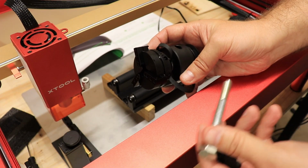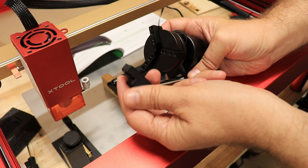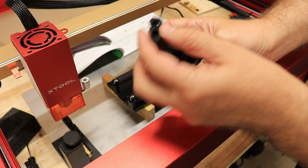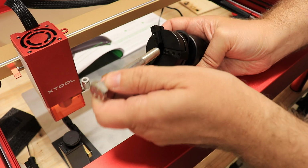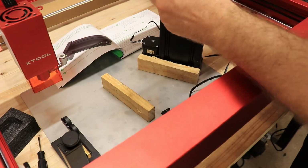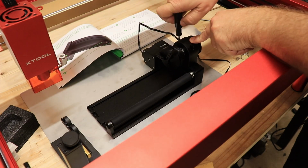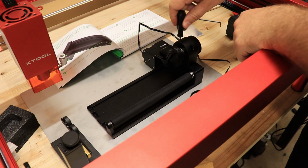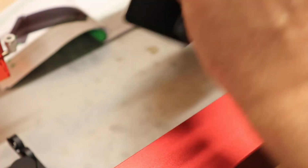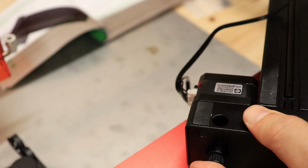And now I want to use the chuck to engrave something on this bolt. Now there are different jaws which can be even 3D printed and they can be mounted here. But in this case I can use it directly with this bolt. I have to remove these cylinders and I have to screw the chuck holder here with 2 bolts. And then I have to install this pulley on the shaft of the stepper motor. And then it will be ready.